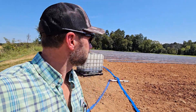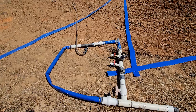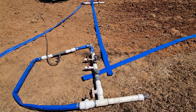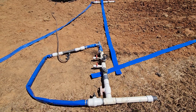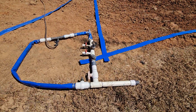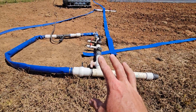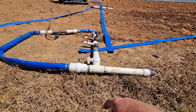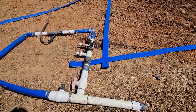If you're ever having trouble getting stuff to inject at your pump when you're pumping a long ways, if you move your injector to the field where you can have high pressure immediately with a pressure drop going into the rows, sometimes you'll have more success — it's easier to inject fertilizer and chemicals that way. This is kind of a hodgepodge mess that I put together out of pieces and parts I had laying around, so it looks a little ridiculous, but it don't matter.